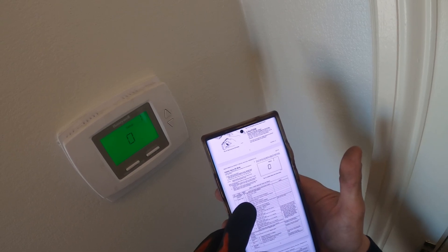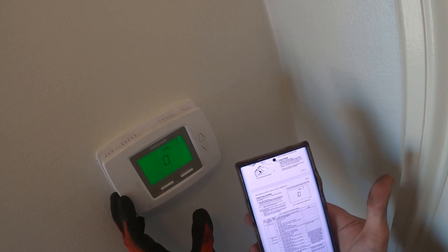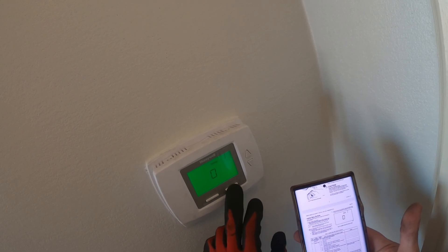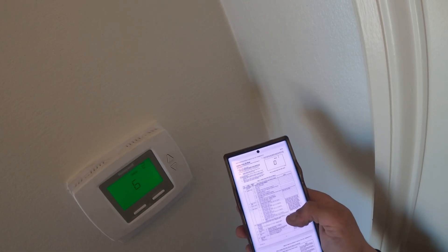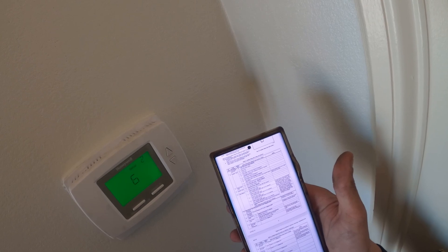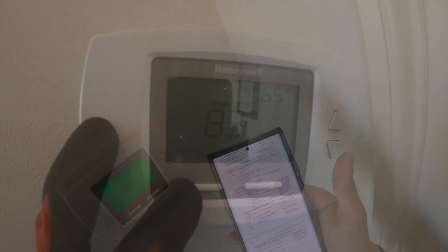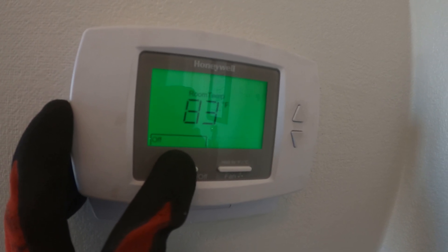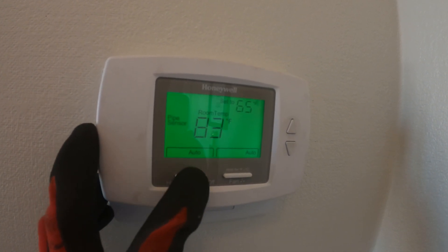Line and voltage option — value zero for 120. Okay. Pipe sensor threshold — range is from 55 to 65. I changed some of the settings, but now something else strange is going on. Now it only goes from off to auto — off, auto. What's happening here? We still have the pipe sensor thing going on.